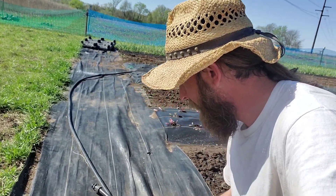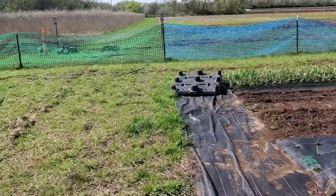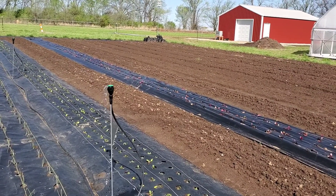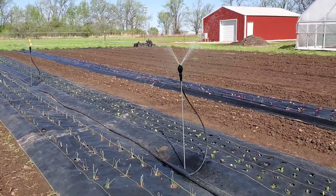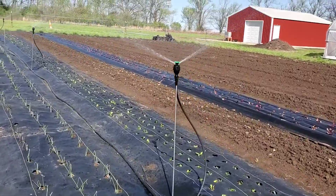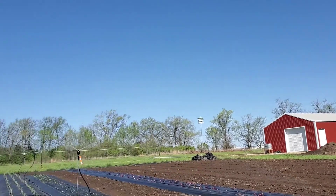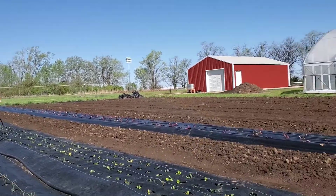These work really great in high windy conditions. I'll go ahead and kick them on real quick. These ones take a second to charge because I'm going uphill. There we go — once they start going you can see the spray actually goes up and down as it moves in a circle. They've got a much larger water droplet on them. That one sprays to that head, and that one right there sprays to this head — which is perfect head-to-head coverage.